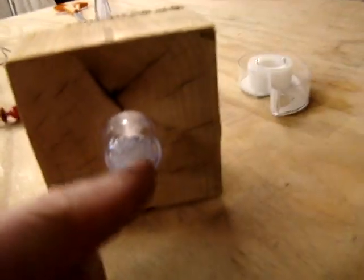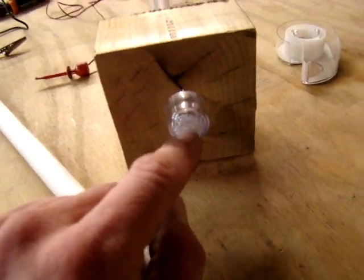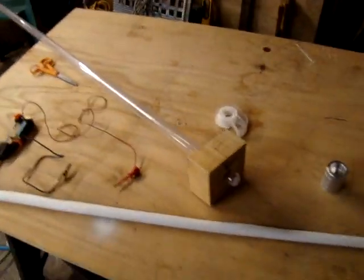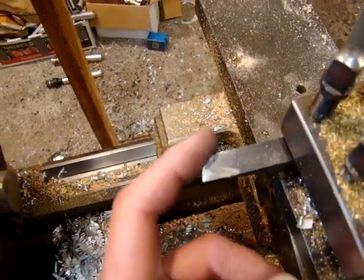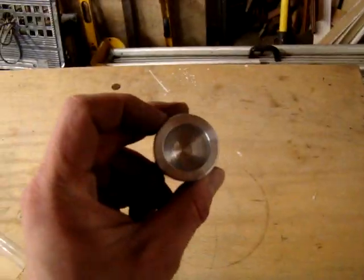And the way this bubbles really acts as a benefit for the saber, because the LED will shine straight out through here, which is one thing you don't want to see. So this acts as a dispersal, or diffusion, I'm sorry, a diffusion part, instead of having to put foam at the tip. So it all kind of helps itself look right. So that's about it. It's just a concave cutout part, and I cut my own tool out on the lathe. There's just a shape there. It's a 1/2-inch bit because the tube is an inch wide, so I just made this a little bit wider.